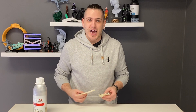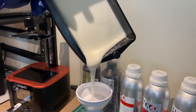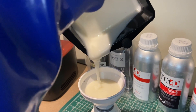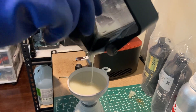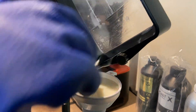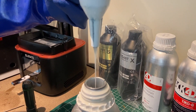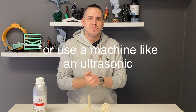So all of these tests were incredibly successful. But what did I not like about Tyco T? The first thing is the viscosity is incredibly high — it's basically resin pudding. This is necessary because if you want these properties, you've got to have some kind of filler in there, and as they said in the marketing, this is the highest filler content they could possibly add. So it's not going to go away, but it was a bit of a hassle. On the note of the viscosity, it did really make washing rather difficult. I stuck these in a bath of 95% ethyl alcohol, and if it just sits there, it does nothing. You will probably have to get in there and scrub them with a toothbrush, because clearing this stuff away requires a bit more agitation. However, if you're already in the habit of using a toothbrush to clean your resin, this probably won't be a big deal.